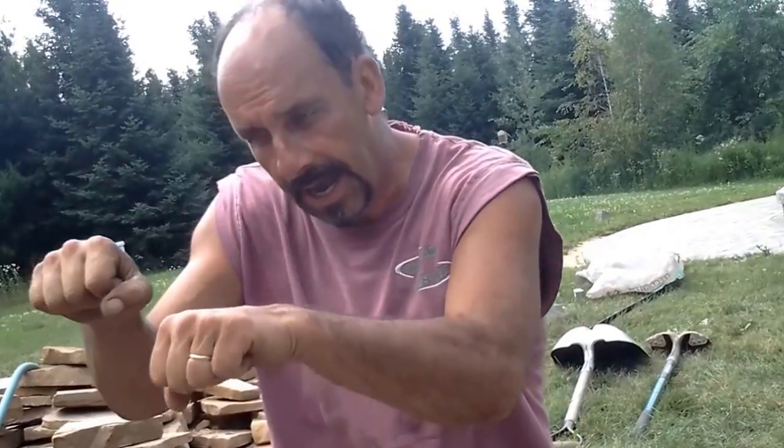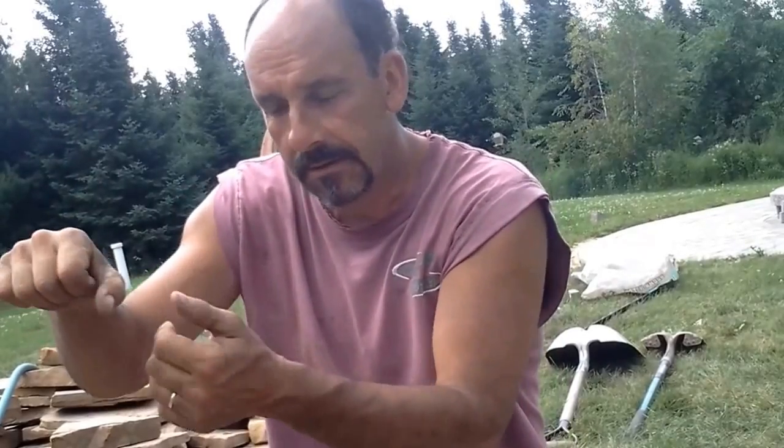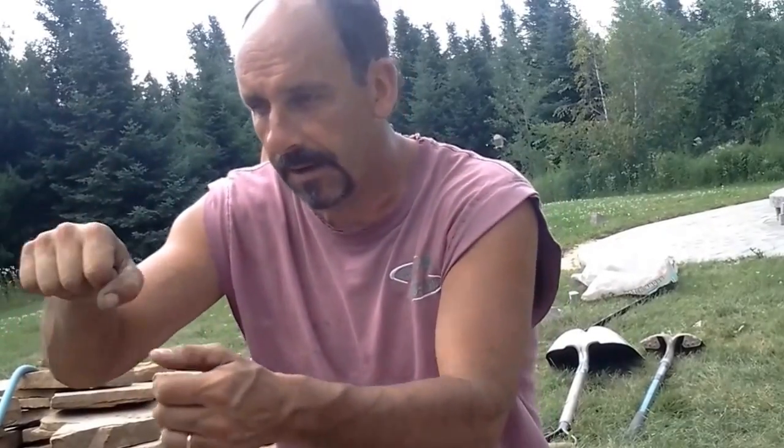The other thing you want to remember, now these chop saws are very dangerous things. I actually had a blade come right off of these one time on me, and you know, you're looking at it and you're lining up your brick, and I flipped the switch, and all of a sudden she was really getting up there in the RPMs. I started to cut the brick. I saw something fly out the side. It ended up being the bolt that holds that blade on, and it was my own fault because we were doing a huge job and I just wasn't paying attention. And I should have made sure it was tightened every day before you use that saw, because that thing is a killer.